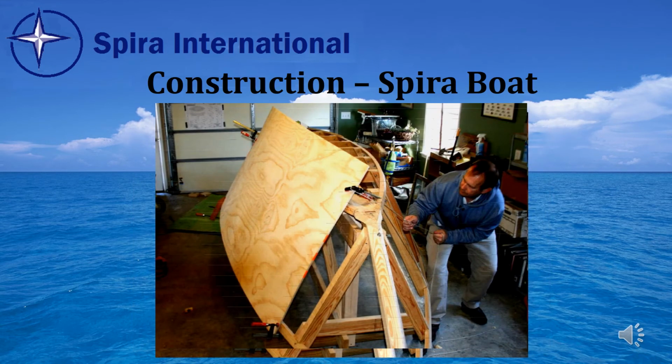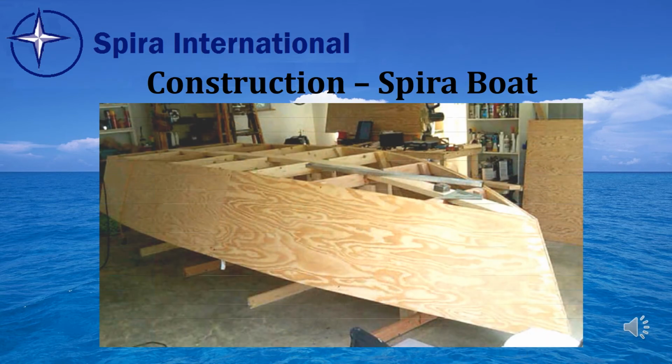Once the glue dries, the assembly that you're working on is pretty stiff, and you can use it as a pattern to cut out the plywood planking that goes over top of it. Here, the builder has applied the plywood to the sides of the boat, glued and screwed it in place, and is getting ready to apply the plywood to the bottom.